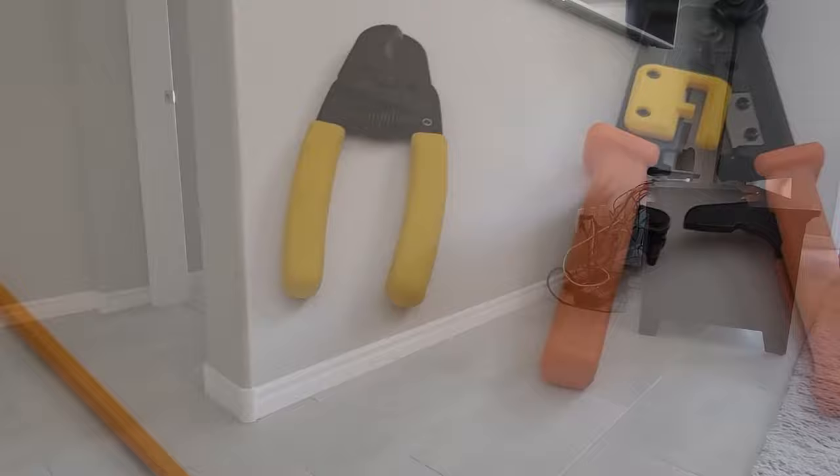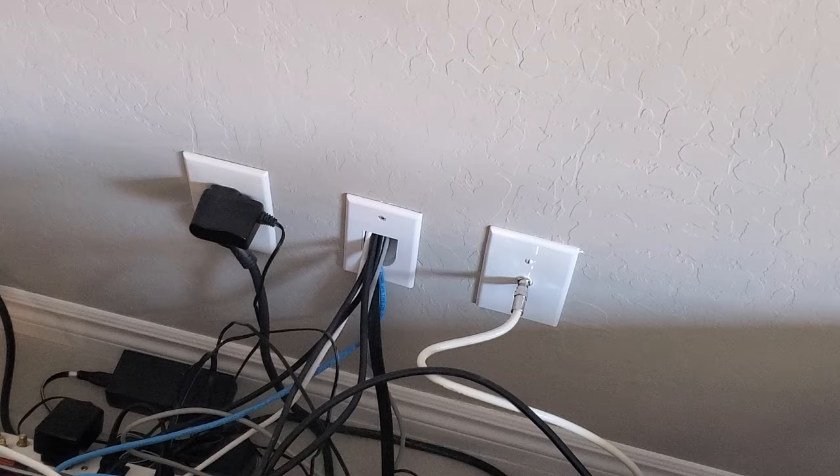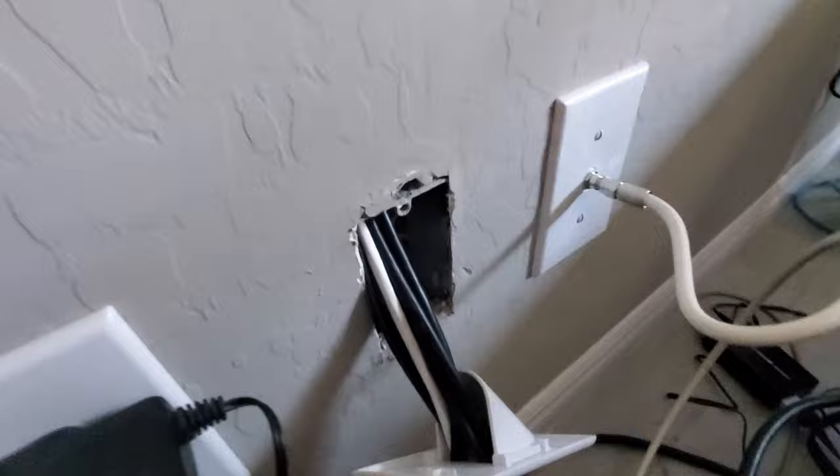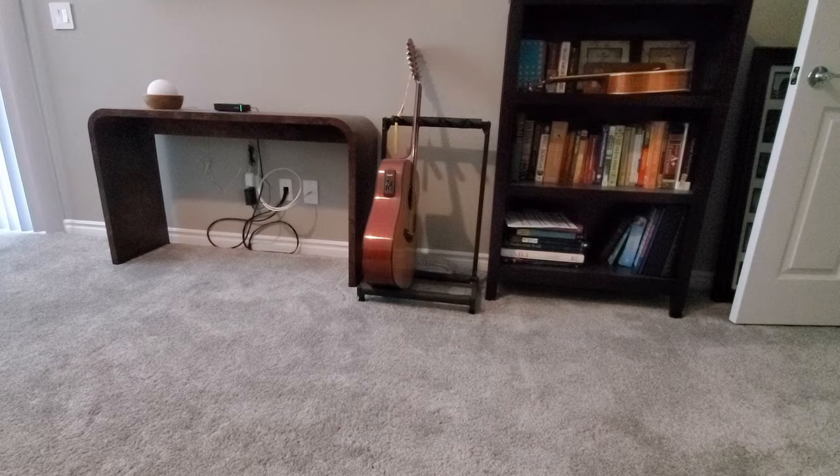The first thing I'm going to do is measure from where the coax cable comes out of the wall in the family room, and then I'll measure that same distance in the master bedroom. This way when I drill the hole I have an idea where it's going to come out. So now I'm going to take off the wall plate — it's really important to make sure the area I'm drilling has no wires in front of it. I saw no wires, and the area behind my guitars is where I'm going to put this wall jack.